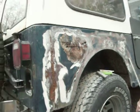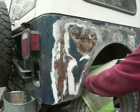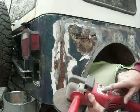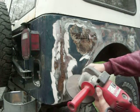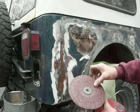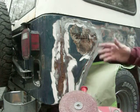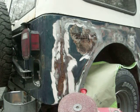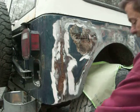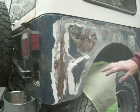I should be in good shape. I've taken a grinder — usually I use 80-grit paper — but because this thing has gotten so many coats of paint and body putty, I'm using this Milwaukee 7/9-inch polisher with what I think is a 15-grit sanding disc. This thing is really rough and you can see how it just tears right into the material. If you try to do this with 80-grit sandpaper you'll use 50 pieces before you get where you want to be.